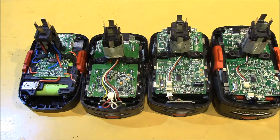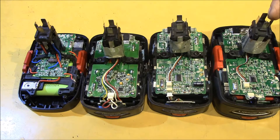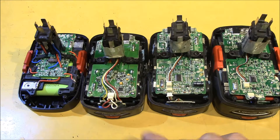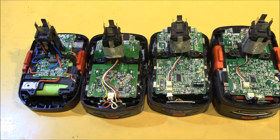Let's take a look at the design of the Craftsman C3 Lithium-Ion Battery Pack over time. Here are four packs I've opened up and taken a look at, ranging from a very early compact model to the latest extended capacity pack. There's a definite trend towards increasing circuit board size and complexity, and also a reduction in the hand wiring over time. Craftsman must be pushing these packs to a higher volume and lower production cost point, and it appears they are addressing some field issues that cropped up over the years with design improvements.